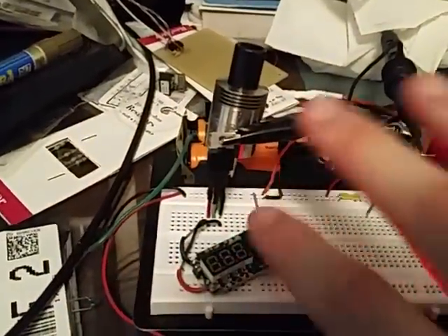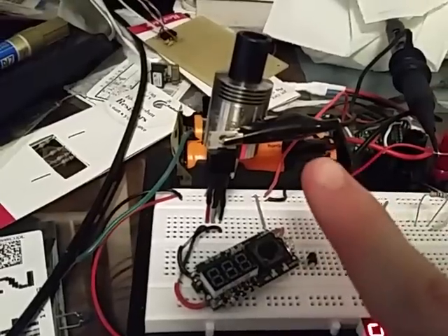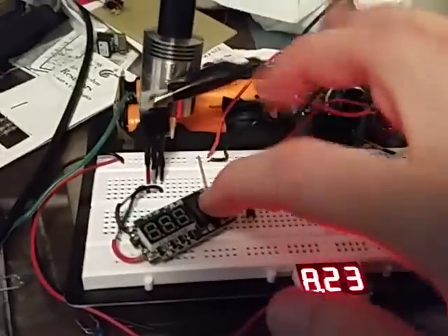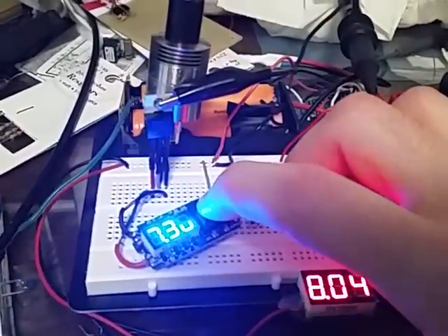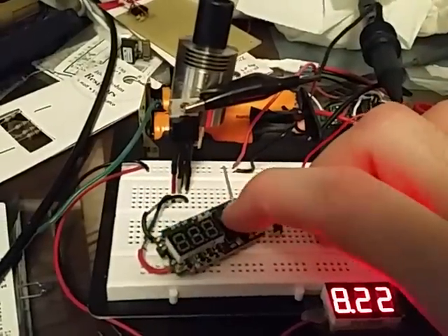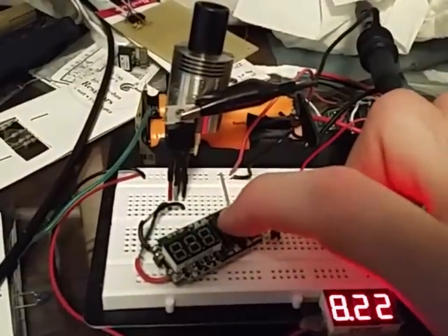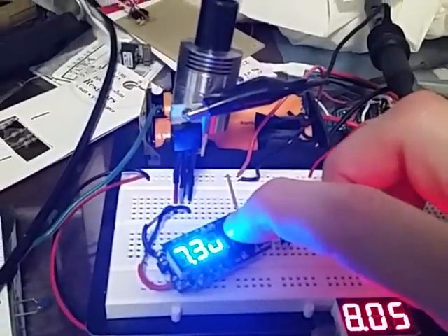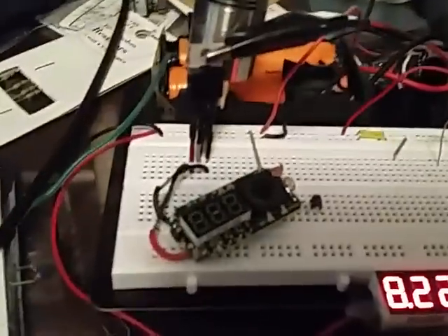So he gives you a fairly wide range of adjustment, but you only have that 6.4 volts loaded to work with. And that's not a pulse reading either — that's a constant reading. So if you drag yourselves down — and notice now it's not even close to being accurate. As you drag yourselves down, I don't know why. It's a Z-Max board, what do you want from me? As you drag yourselves down you're going to have a harder time doing a high duty cycle. So that's a limitation, and that's a limitation you're not going to see with a 555.